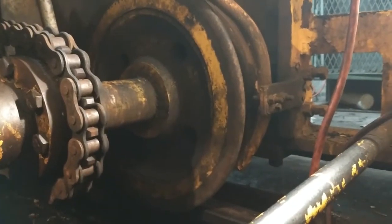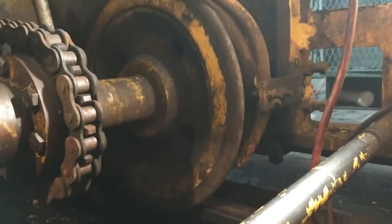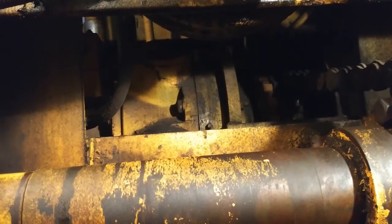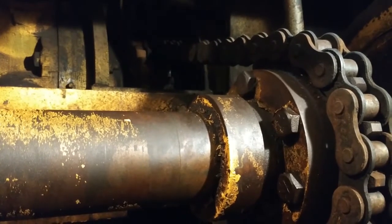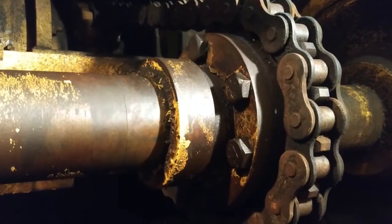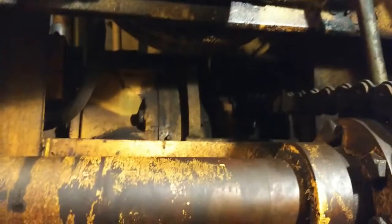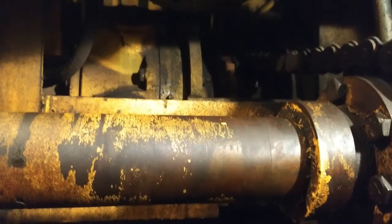Moving to the underside of the locomotive to give you more of an idea of how this works — this is a three-foot narrow gauge switch engine. The motor up top runs a hydraulic pump, which goes to a hydrostat over there, possibly something similar to what you'd see in an IH-715 combine. That hydraulic motor runs a set of roller chains to each axle. There are no leading or trailing trucks on this — it's just four powered axles.